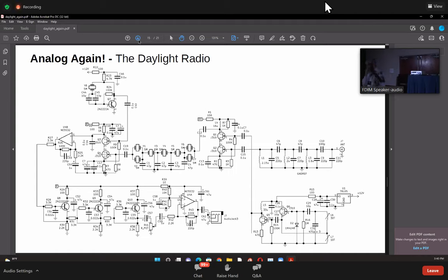The FETs, you mean? Yes. Yeah, they're very easy to get. Actually, at Dan Small Parts, I bought 10 of them for $2. They're still in production. They're available on Mouser. Mouser yesterday had 5,000 of them available. The SMD parts are even cheaper, so that's less than 10 cents per transistor. Hoard them up before they go out of stock. The J310s are really good transistors.